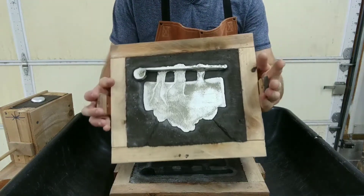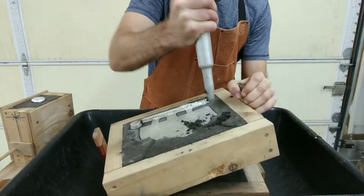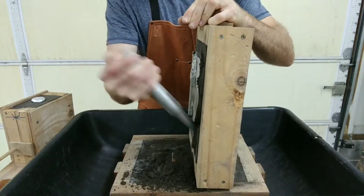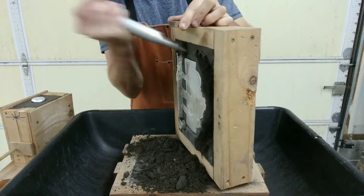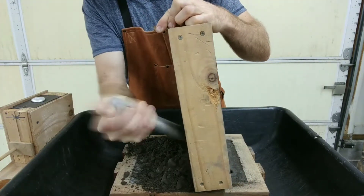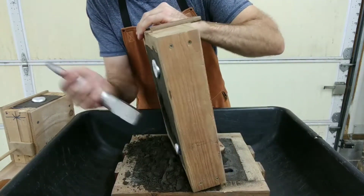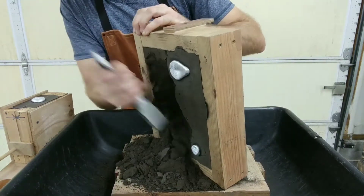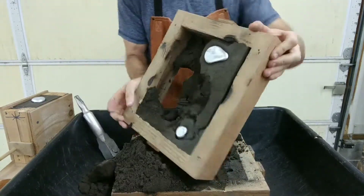For this you can see that I used my horizontal flask. I used three gates coming off of the runner to enter the mold cavity. I wasn't really sure if I should use one large one, so I decided to use three smaller ones. You can also see here that I poked a bunch of holes in the top of the flask to help give it a better venting system.